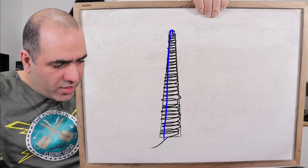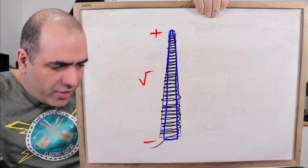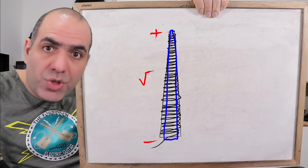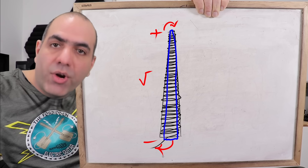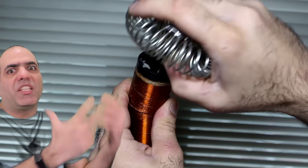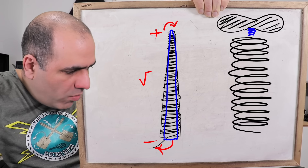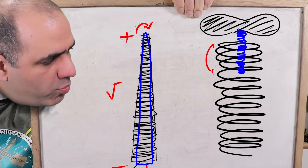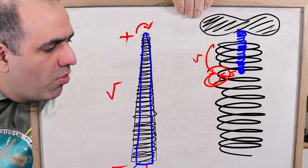The reason for this bad coupling between primary and secondary windings is that, unlike other transformers, Tesla coils don't use ferromagnetic cores and only use air core, which is a piece of junk when it comes to cores. If we actually use a conductive ferromagnetic core, because the voltage across the secondary of a Tesla coil is huge, having such a conductive core places super high voltages very close to each other, and so the voltage will arc through the insulation of the wires and short the coil. I did see this when I was running my Tesla coil in vacuum, which melted my secondary — all because I accidentally ran a screw too deep inside.